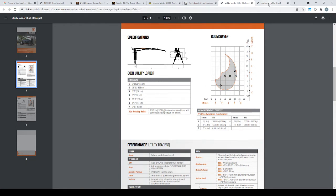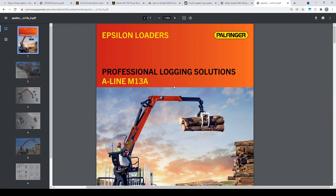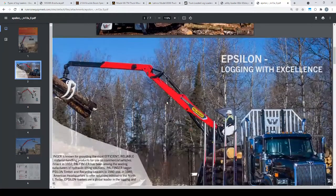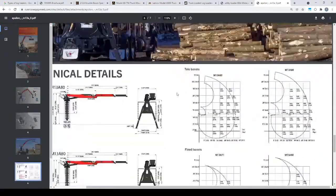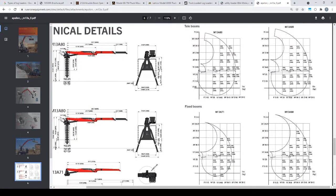Last but not least, we've got the Palfinger. They've been building loaders for a while now and it's a very modern design. There are no hoses on the sides of the boom — they're all internal. So there's less chance of breaking one off by hitting something. It's definitely harder to change when you do break one, but hopefully that's down the line. I was kind of leaning towards this loader out of all of them because it's a little bit lighter weight — it comes in at 5,300 pounds and it'll lift about 5,500 pounds at 15-out and 15-up.